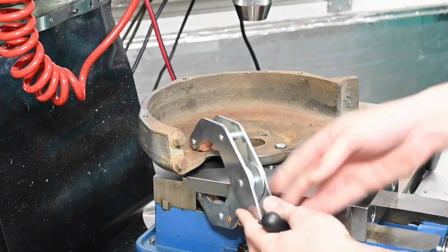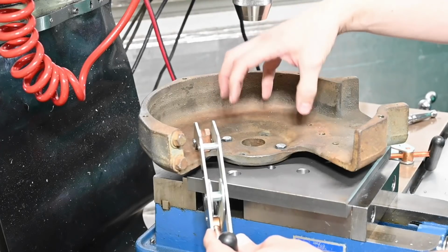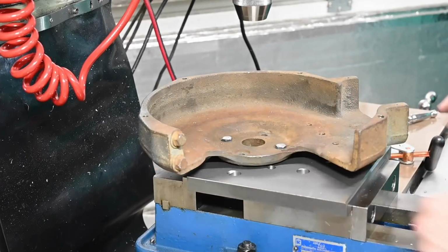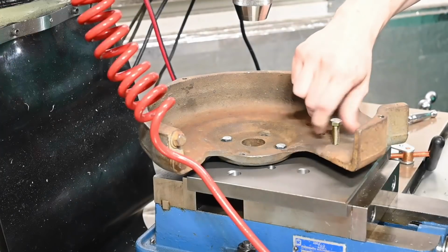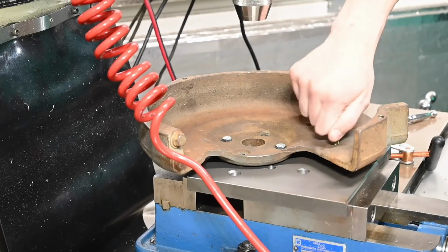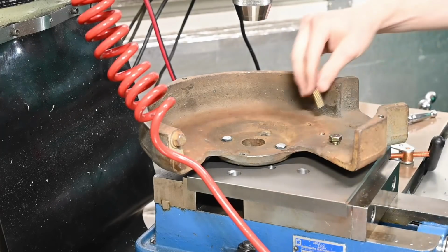like this. That'd be fine for holding it down, but then of course, as soon as this cutter goes all the way through, the clamps will pull down, and the excess will flop around and be not as safe as I'd like. So if we thread these guys in, they'll serve as jacks and just push against the plate on the backside here.